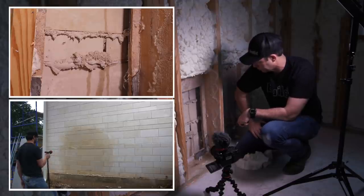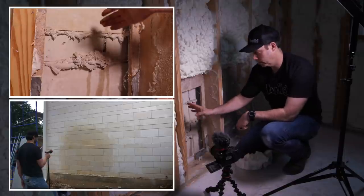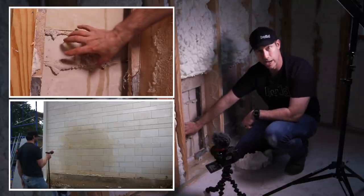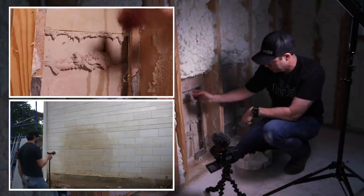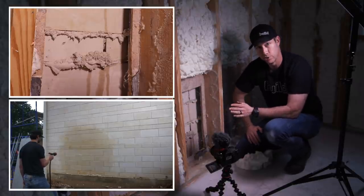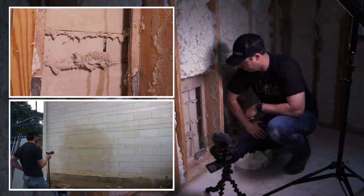What does this cavity have going for it, though? What does brick and stone have going for it? There's an air gap back here. The mason did a real nice job of not having mortar droppings filling this cavity, which means that this liquid water is probably not going to hit the face of our house wrap. We're going to have vapor drive issues, but we're not going to have any liquid water hitting this house wrap, at least not in this location.